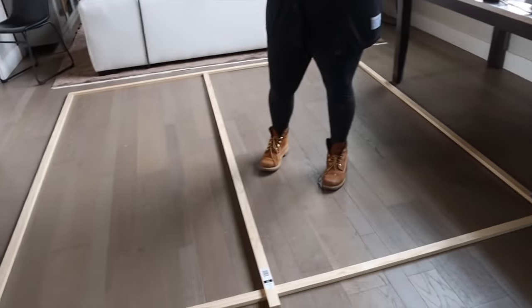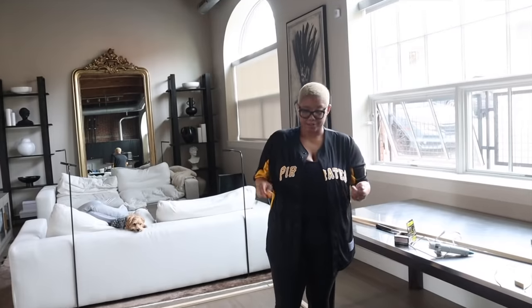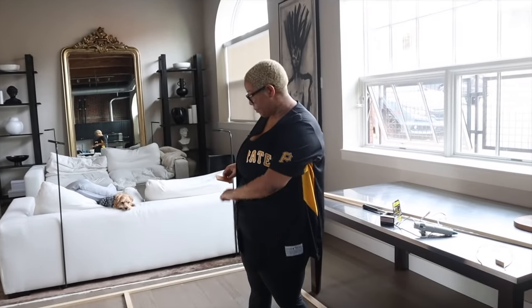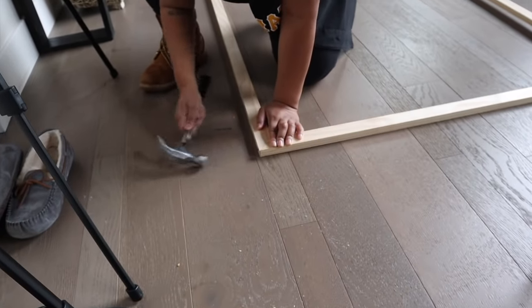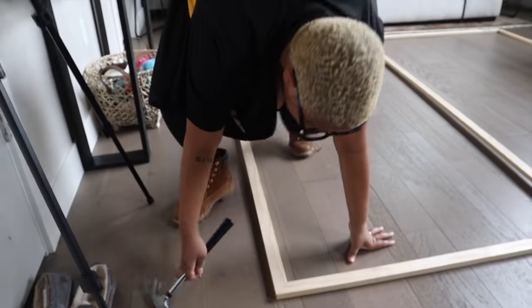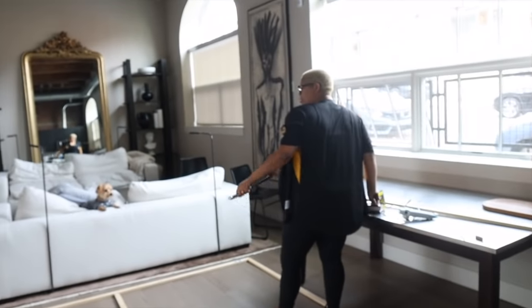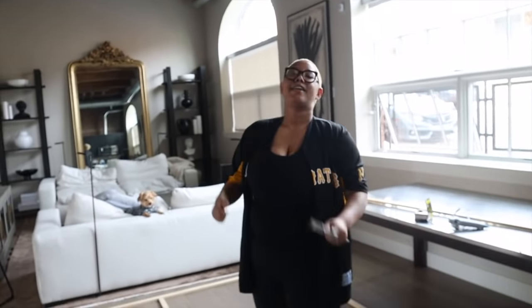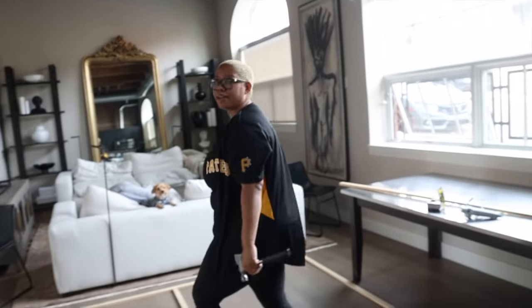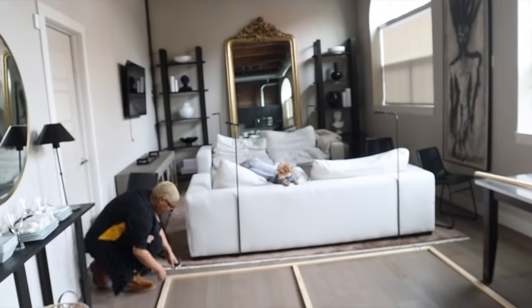There is a slight gap, which will be remedied with the nails — and also you're not going to be able to see it. Now after I hot-glued everything, we're going to put the nails in. I'm using one-and-a-half-inch nails. I only hit my finger one time! I'm doing all the way around because the hot glue worked really well. It's not just standard hot glue — it is gorilla glue hot glue, and they sell it at Walmart.